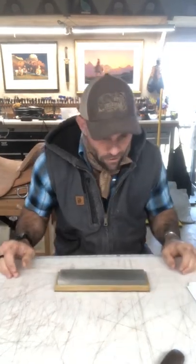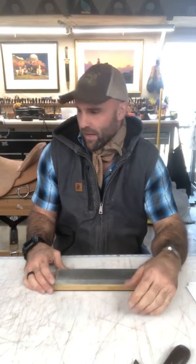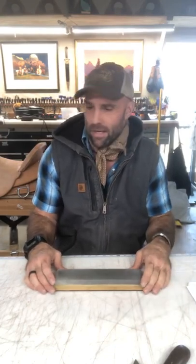Supplies necessary: stones. If your knife is already pretty dull, you're going to need several grits. If it's pretty sharp, you're not. I use hard Arkansas stones. I use hard stones to finish — this blade I only use for one thing, so it never gets very dull. If you do less maintenance than I do, you're probably going to need a couple different grits. In the shop, I generally keep a coarse crystalline stone for reprofiling, and then a soft Arkansas and a hard Arkansas.